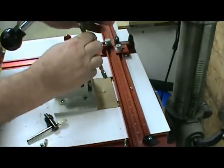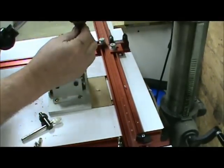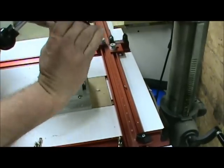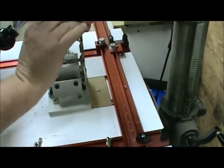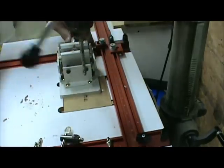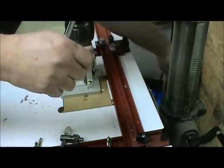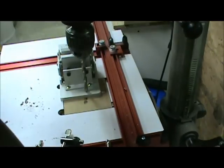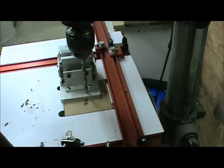All right. We're going to go up to the 3/8-inch drill bit. Drilling these holes in sequence is very important, that you get it straight, that you do it down through the center. If you're off center, it throws your scallops off center. That's why we're chasing the original hole.